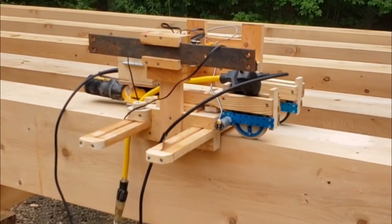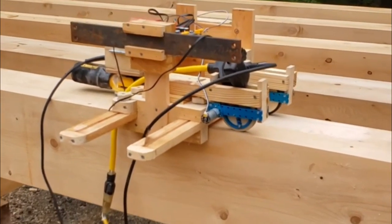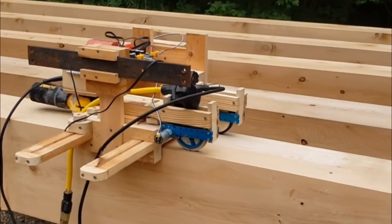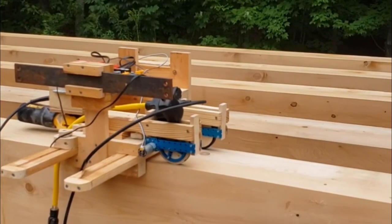Originally, I planned to have the robot motors drive the tires to push the machine with no gear reduction, but their low torque meant that I had to buy 4 aluminum gears and build new wheels and frames to give the motors about a 5 times increase in torque.